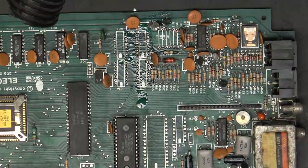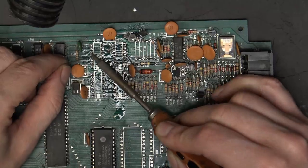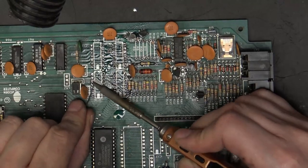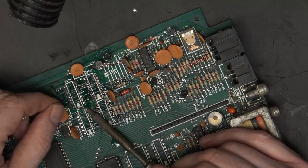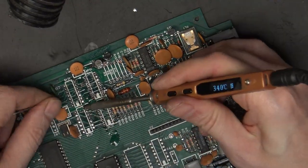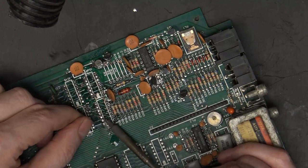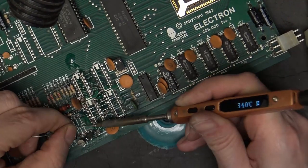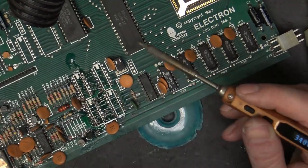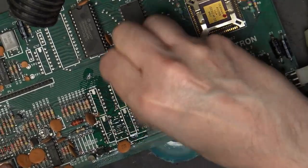And you may have noticed that some of those pads just don't look very shiny. So now we're going to reflow solder on the top and a little bit of gentle rubbing just to clean up the corrosion that was on the top. And like I say, what we don't see is that I actually do this with a fiberglass pen afterwards. It was a few days after, to clean up any corrosion that may have been on the silk screen of the tracks that were left.